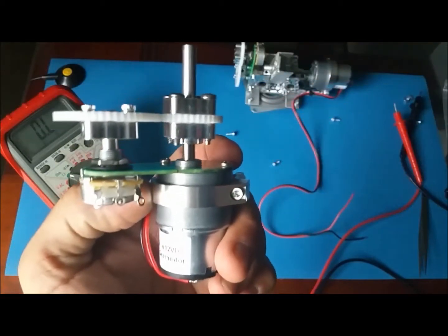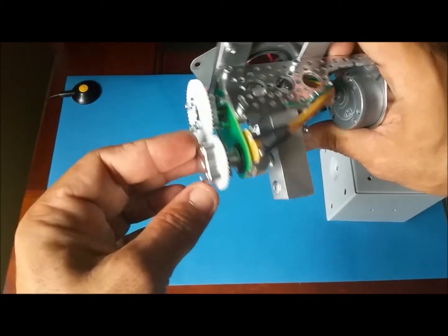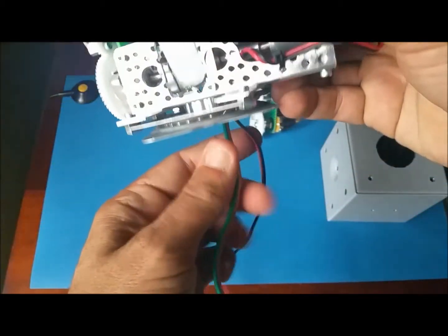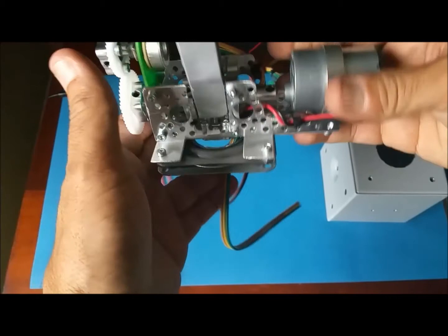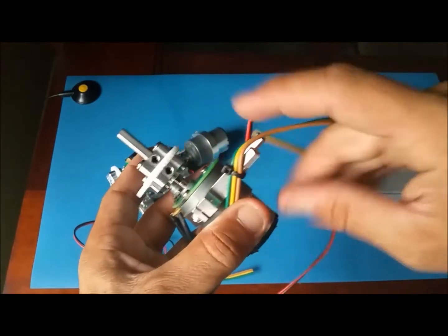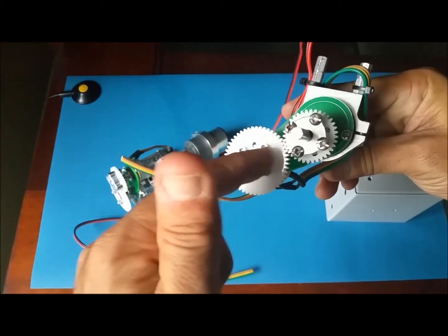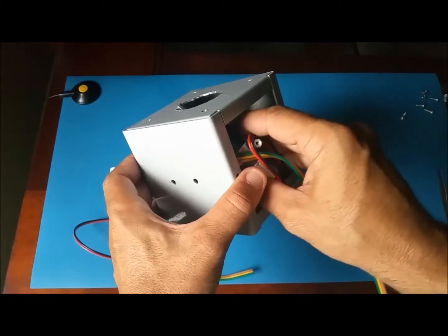And yeah, I went ahead and I soldered the cables for the potentiometers. Here's this one here, and then I put another zip tie here as a strain relief, and then they're coming through the center. Did the same for the Azimuth one, the cable, and then zip tie there. We did the potentiometers earlier, set at 5K. Next, we're gonna put the motor inside the box.